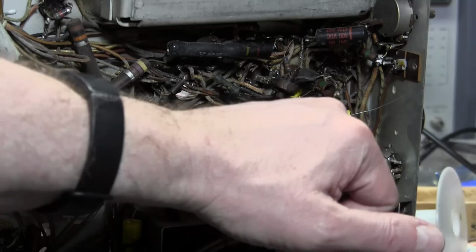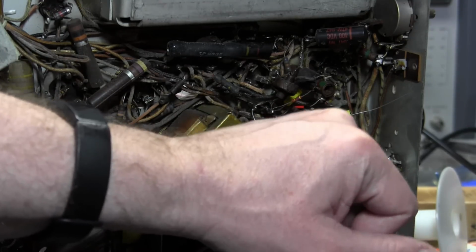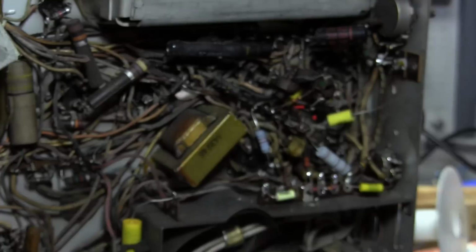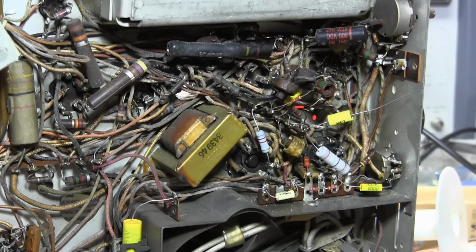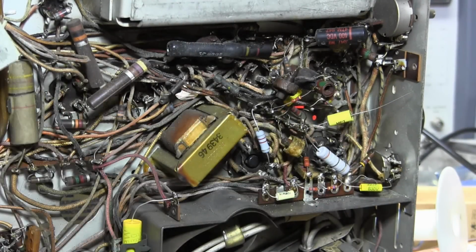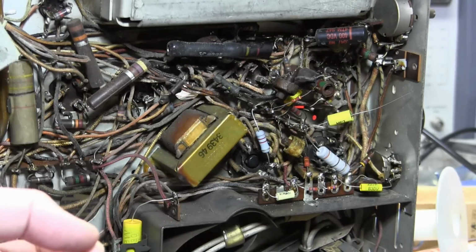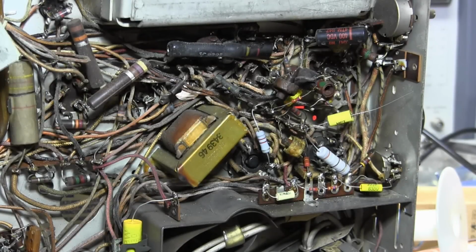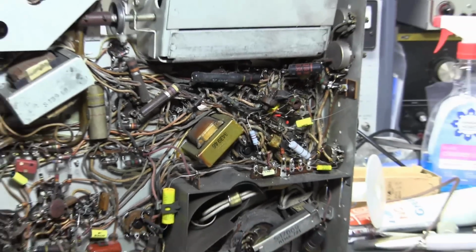So this actually is a video amp. So the one area where there was clearly some repair work done was around the video amp. It's a pretty important circuit. Definitely impacts signal or image quality, I should say. So I'm basically rebuilding that entire circuit. And then I want to move on to the power supply. So in other words, I rebuilt some of the more critical circuits.